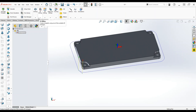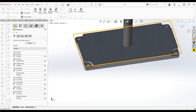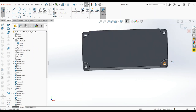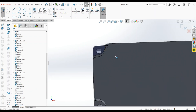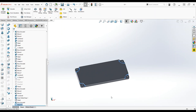Let's do another 2D adaptive tool path. By default in HSMWorks and Fusion CAM, all feeds and speeds carry over from the last operation, so the tool carries over — that's good. We want to clear out these corners. We'll create a sketch on this plane, convert these entities, come in here and drop these off. Convert these entities, go to power trim to trim all this stuff off.